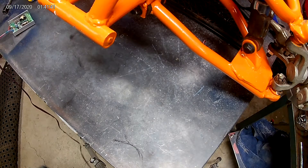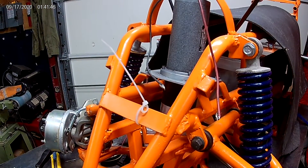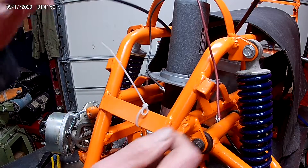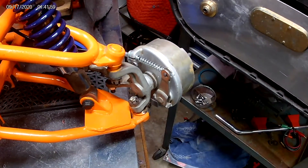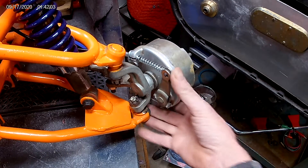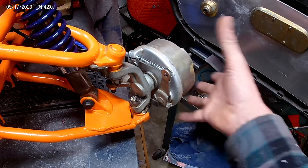What I'm going to start working on now are the brakes. Originally this machine had two sets of brakes. There was a pedal that operated a master cylinder for a rear disc, and the handle operated cables for the front. So if you look down here, these cables here — when you pull on the cable, it used to be that the operator would pull the handbrake, and it pulls on this cable and it applies the cams inside, and the brakes come on.